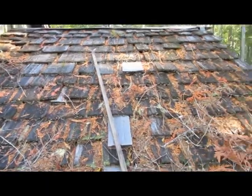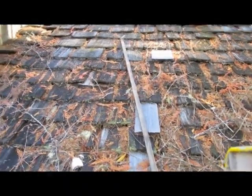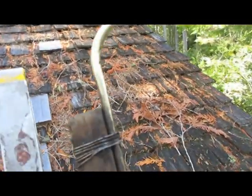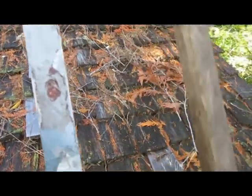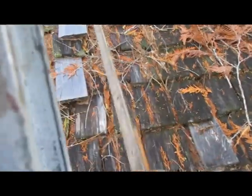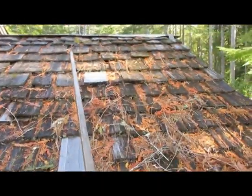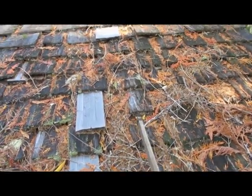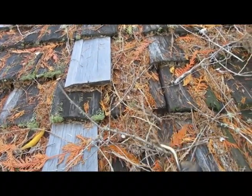There's a roof badly needing to be cleaned — you can see the light-colored shingles are the ones I slipped under. The tool I use is pretty simple: just a piece of quarter-inch or five-sixteenths brass that's been shaped and put on the end of a lightweight stick. The stick is at least eight feet long but I put extensions on and take them off according to how I'm using it. I put this between the shingles, pull the debris out, then turn it sideways and pull it across.